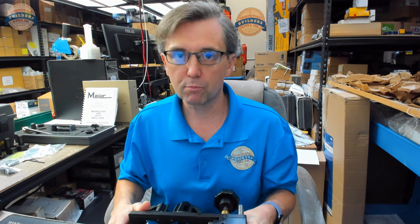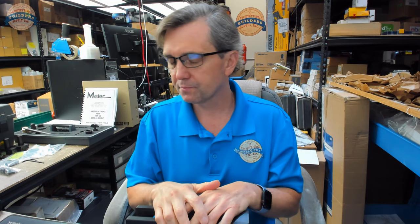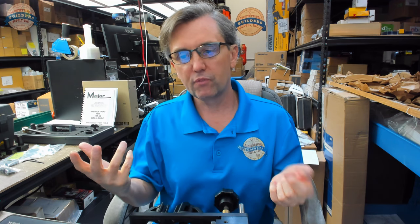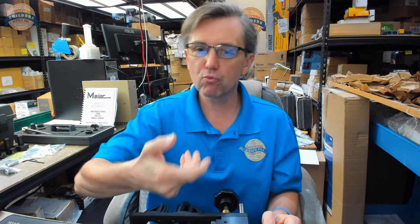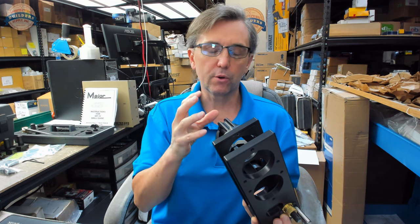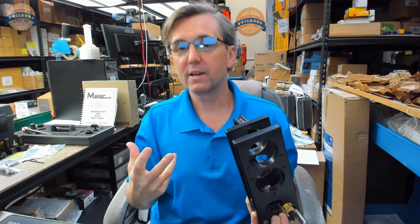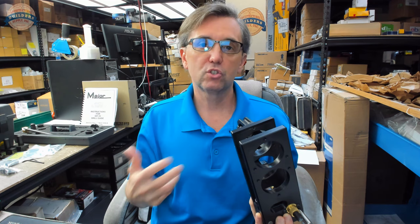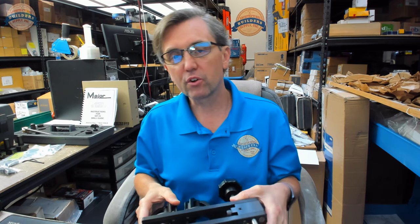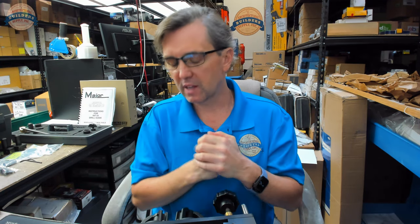So we've really ritualized the process when we've said, here, and then you demonstrate it once. Now, what I like to do when I'm prepping doors is, if you have another person available and a shop vac, have them right there with the shop vac capturing all of it, because multi-spur bits are really messy. They're awful. They are really ripping everything. The other reason I like hole saws is because they really minimize the amount of wood dust and chips that are created. It's harder to get that core pushed out of the hole saw, but there are slots on the side of the hole saw that you can use to push it out.